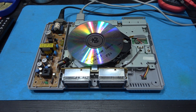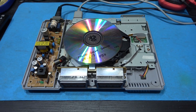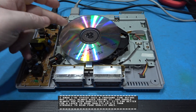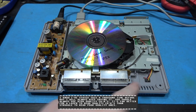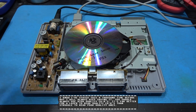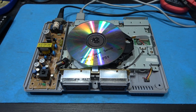What I've decided to do first is calibrate the laser on this PlayStation. I can do that because it's already got a mod chip in it — normally you'd have to mod chip first before you could boot a CDR. I'm going to be replacing this mod chip for a stealth version anyway, but I just want to get the laser calibrated first so when I mod chip it, I can just put it all back together and we're ready to go.